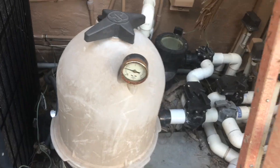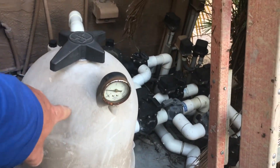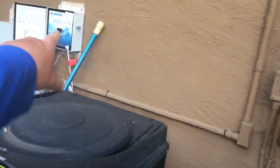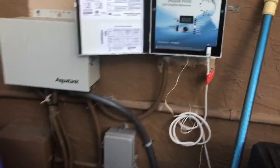We have very good flow right now — just to show you, the pool is circulating, pool is on, pool is flowing. So when you have all these different things checked out, you're getting good flow and good pressure, and you've confirmed your filter is cleaned out, nine times out of ten you're definitely having an issue with either the system itself or the flow switch. Our flow switch is located right under there — that's our flow switch. We have our salt cell right here and our flow switch over there. Right now we have an Aqua Rite and it's showing the signs of no flow.